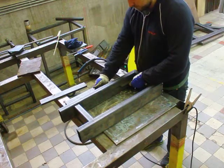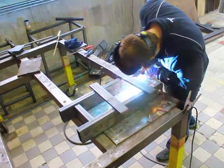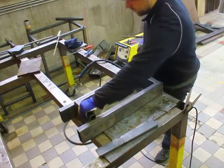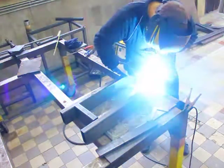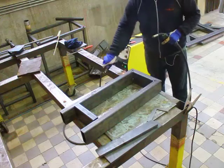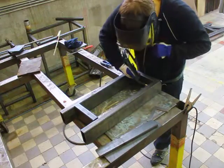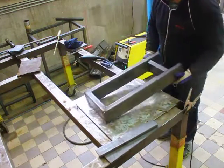As you can see, I'm making the frame with two 45-degree cuts in the front, and both back sides are open - this is actually by design. Once the frame is completely manufactured, the rails are mounted, everything is dialed in, and even after the frame is painted, I'm going to fill those tubes with epoxy granite. That's gonna add a lot in terms of dampening quality, and in addition to dampening it gives a bit of weight and a bit of extra stiffness.